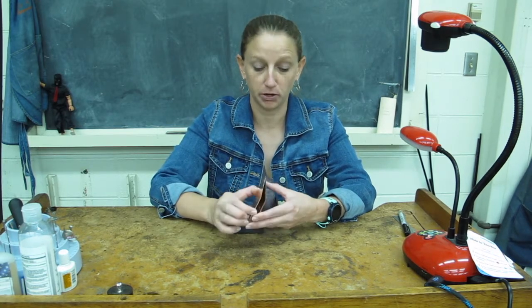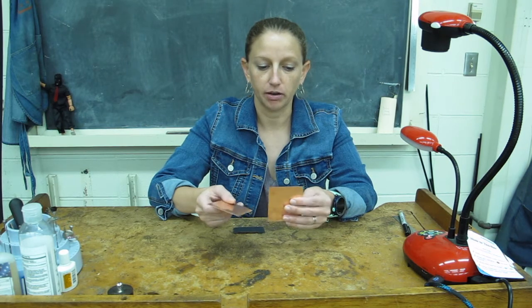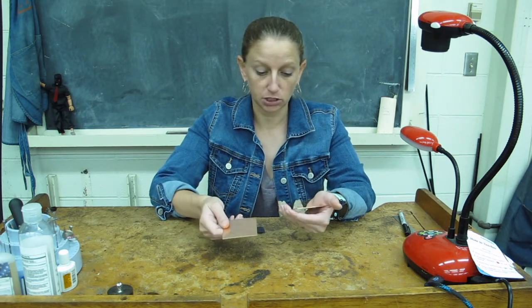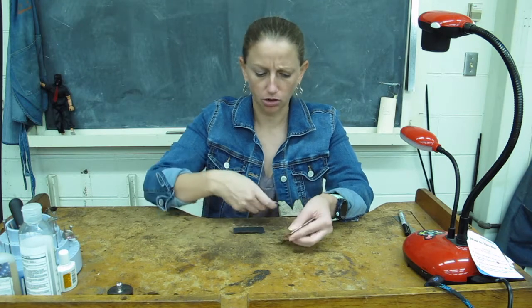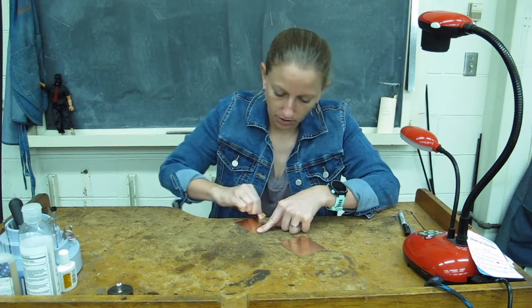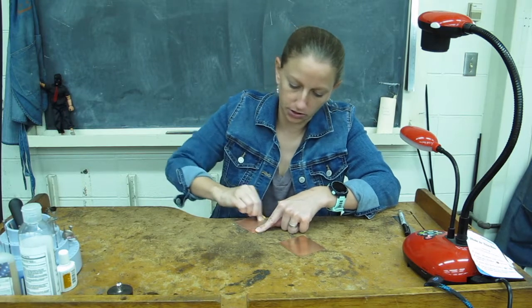Step one of doing roller printing is that I need two pieces of metal. I'm going to always have a sandwich once I put this through the roller. I've already pre-cut two pieces of material and I'm going to clean them up a little bit. One of the things about doing a roll print, especially with a really unique or subtle material, is that you don't want any previous scratches in the metal to show up in your pattern. I have some 400 grit sandpaper and I'm going to pre-sand my metal on both sides so that I've got two really usable pieces.